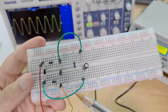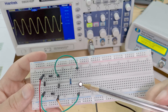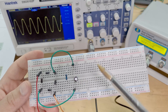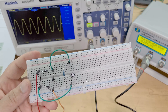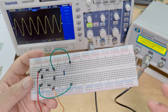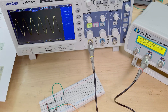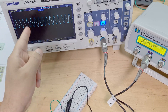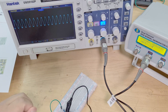That's how it's going through the circuit. It's a bit tricky to set up but at the same time it's not too difficult. Let's show you the output now across this capacitor. We already know from the first video why the capacitor is there, so I'm going to remove the capacitor - let's just look at the output across the resistor. Here's the output - you can see instead of the sine wave going down with the negative half cycle, it's now flipped so that they're all up here. That's what you'd expect to happen, and that's what you see in my simulation results as well - it's now perfectly being rectified.